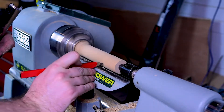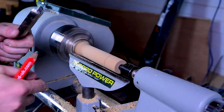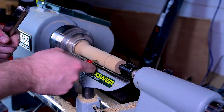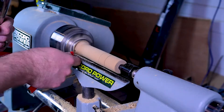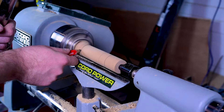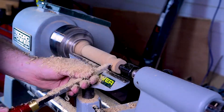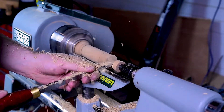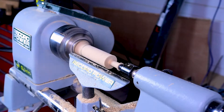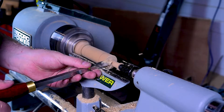The shaft will go into my drill chuck — something like that long and less than 13 millimeters, which is the maximum my drill chuck can take. We'll have an end there that will be our block for pressing into the chuck. The chuck pieces are going to stay as they are; that end will be there and I'll just cut it off back here and waste all this material in between. That's 13 and a half millimeters now, so a little bit more and this will fit into my drill chuck once I part it off.